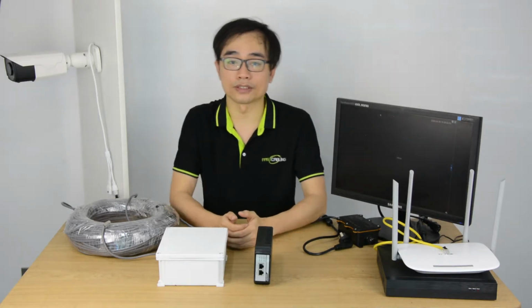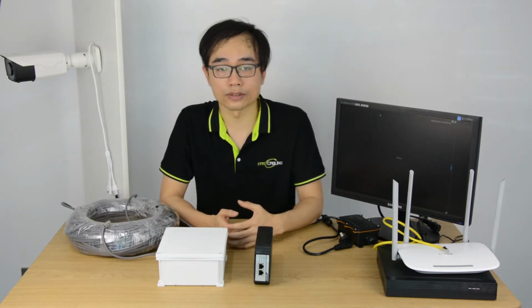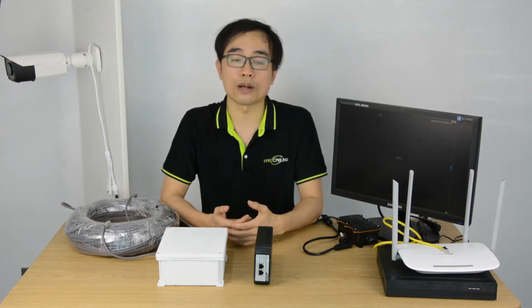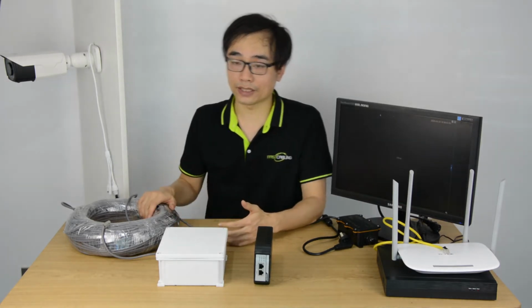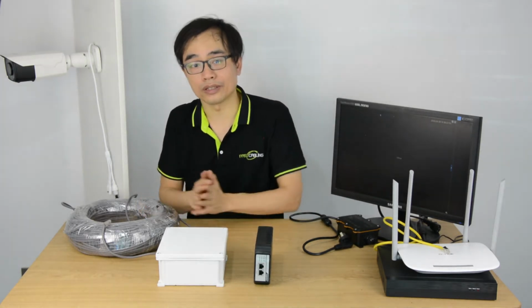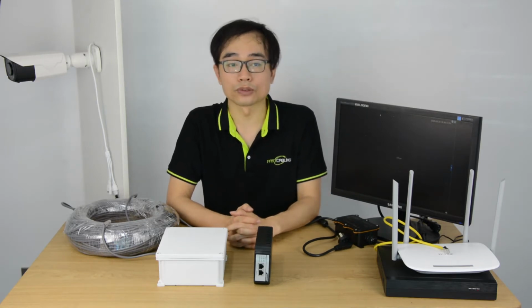The next thing is the surge protection. Even if we can set up the lightning rod to avoid the direct lightning hit, there are still many surges in the environment which may be picked up by the internet cable and stream back to the switch. The last but not least is the waterproof. The water can leak back to the switch and destroy the electronic PCB board.